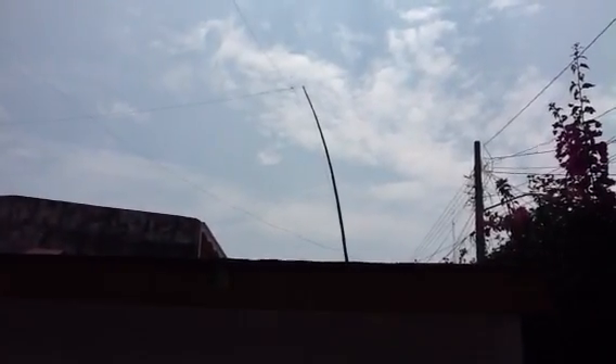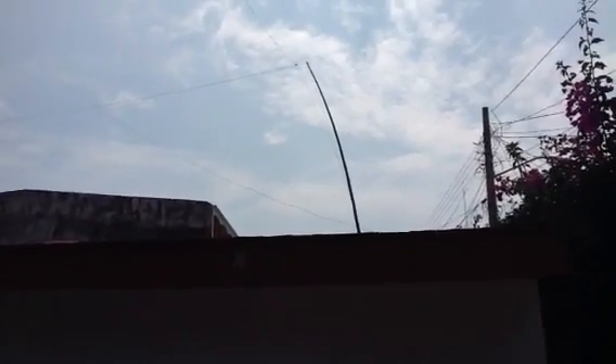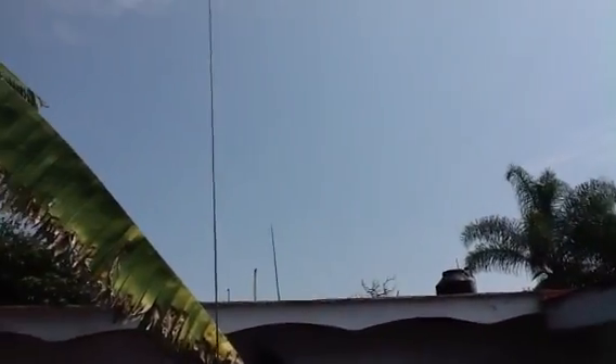Hello, I'd like to show everybody my antenna system. See that big bending pole there? That is my one corner of my loop antenna. It's 230 feet long wire parallel to the ground, up about 24 feet. And it goes from that corner of the front of the house all the way back to the back there to that pole.